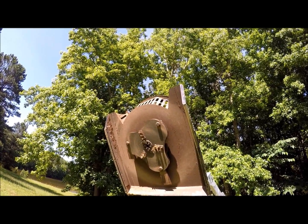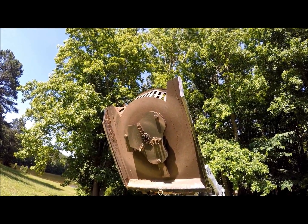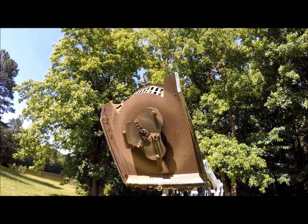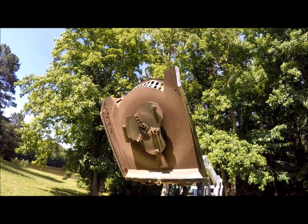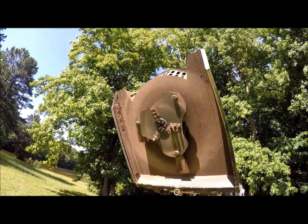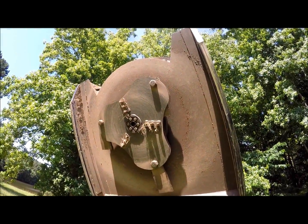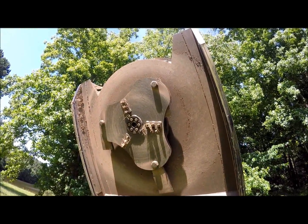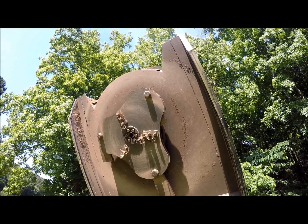But in terms of strength and the amount of mass that you have rotating up underneath this thing for your cutting ability, I think the sandwich plate design would definitely be considered one of the stronger designs that's out there right now. Now, as far as the carbide teeth are concerned, if you wear those down, then they would have to be cut off of the bottom of the carrier. And then they do have replacements, so you could get them and just weld them right back into place again.